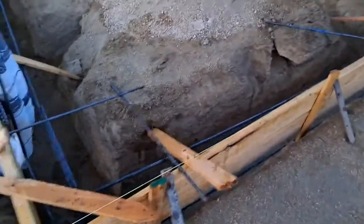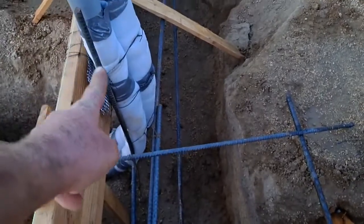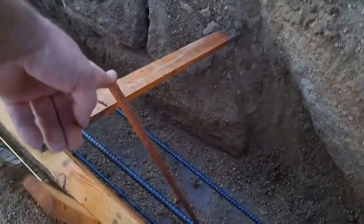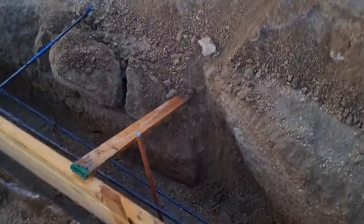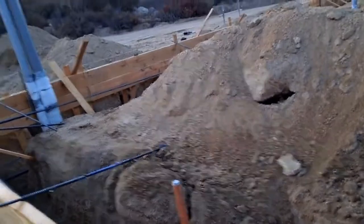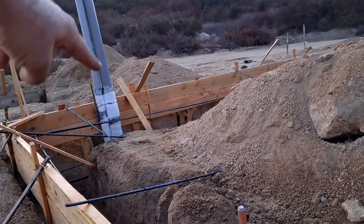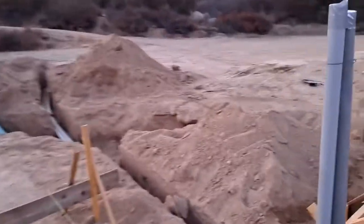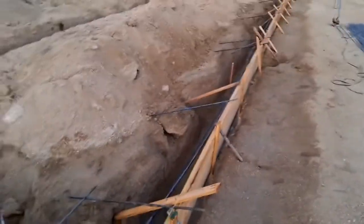He's also going to do a grounding rod inspection. I did two rods because this building is going to have solar. This one here is a ufer - it's a 20-foot piece of half-inch rebar that comes all the way down. I also added an eight-foot ground rod and jackhammered it all the way down today. It'll stick up about six inches above finished floor. The whole panel will get grounded to the ufer and also to the ground rod, which is eight feet from the panel.